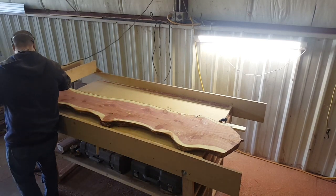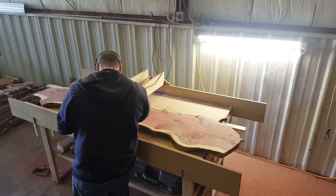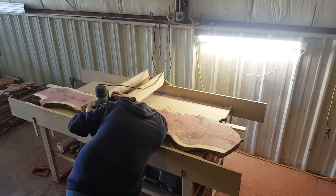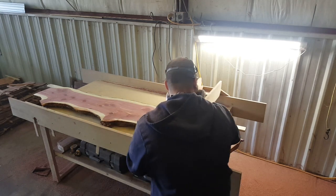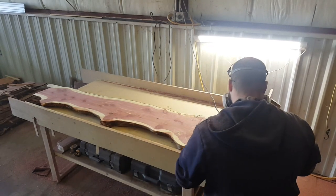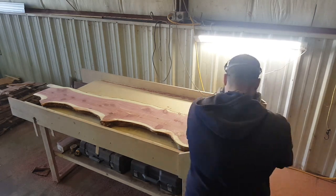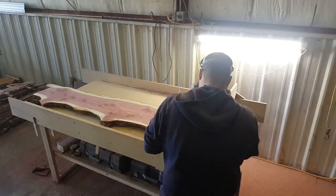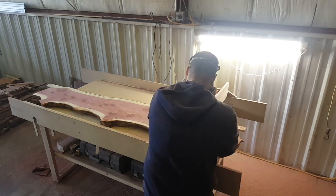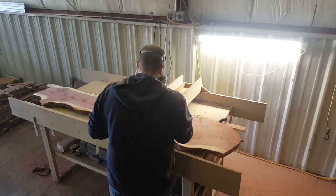I love this view. Joel is now going to set up the depth that he needs for his router. He can move the router down — since we've already done a single pass, he's probably going to move it down about an eighth of an inch, maybe a quarter if your router is strong enough. We currently use a Triton router that's three and a quarter horsepower, which allows us to flatten material pretty easily. We use hardwoods like black walnut and it doesn't have a problem working through those with a reasonably sized bit.